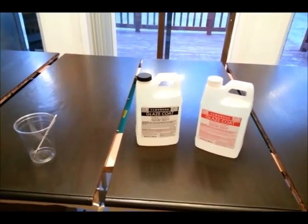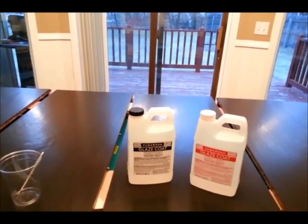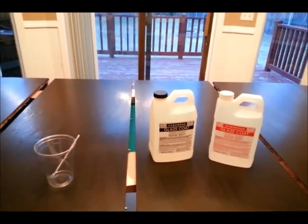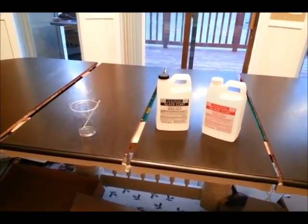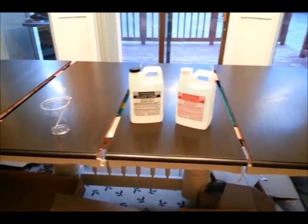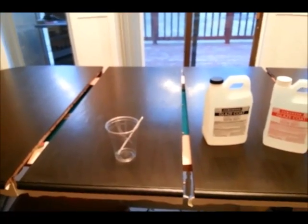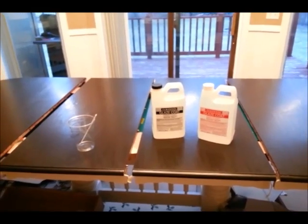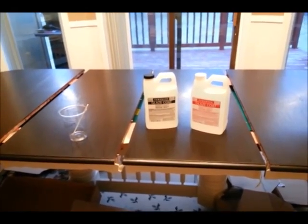When you are working with glaze coat, it is imperative that you wear gloves. No matter how careful you are, it always gets on your skin for some reason. I'm going to do a thin coat on each section, letting it rest for about six hours, and then another coat over the top — so a total of eight applications. It is a bit of a commitment, but I had a disaster with my shellac, and at this point I just want a really good coat on my table, so I'm going to go by all the rules.